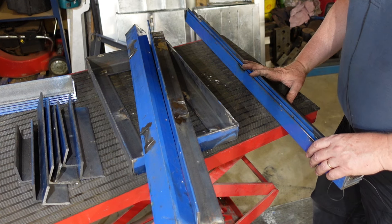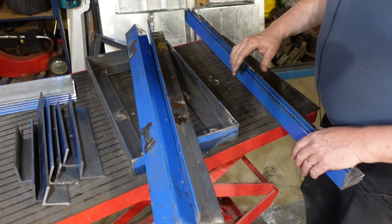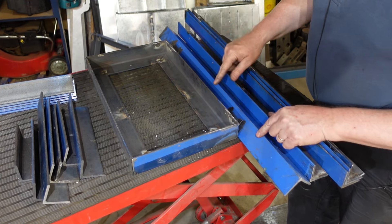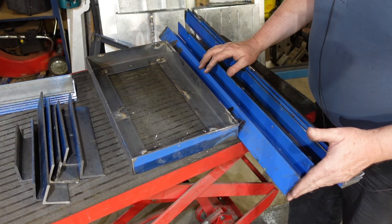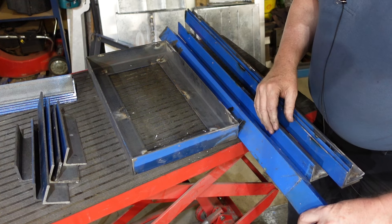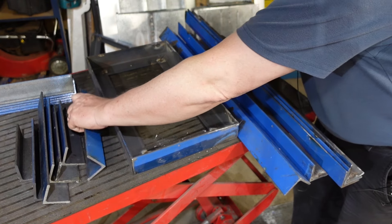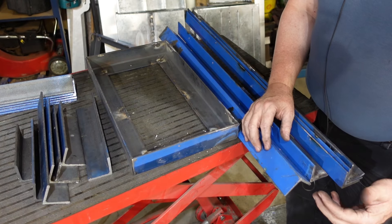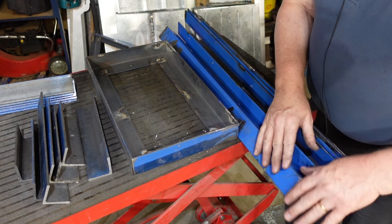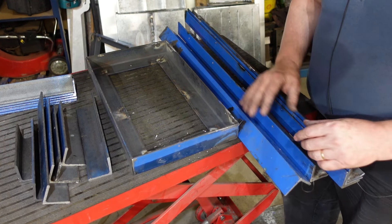This is pretty much all of my salvage material. A couple of things with this one: I'm going to have to add some short pieces. Now the temptation is to say I need to add 30 millimetres, so I'll cut a piece 30 millimetres long. What you're better off doing is having a piece over-long, welding that on, then cutting it down to the size you want. The reason is that if you have a short piece, not only do you have problems holding it in the right spot, but you also have problems with the heat.